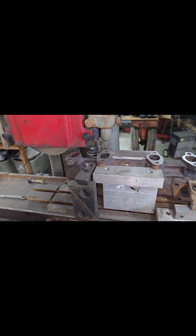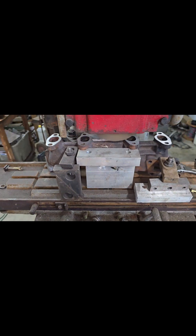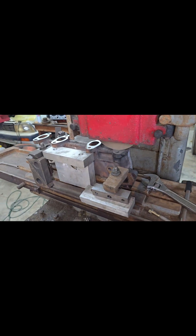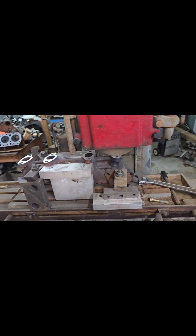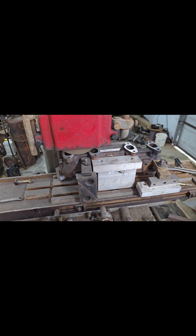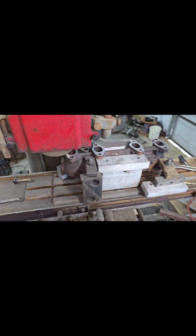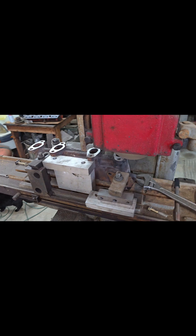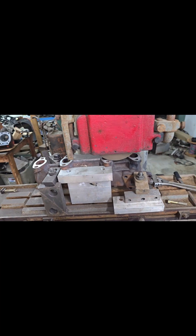This setup's pretty terrible — you shouldn't use aluminum blocks — but the trapezoidal flange was positioned in such a way that I had very few options on tying it down, so I had to go that route. It seems to be holding pretty good, and it's flat off the back sides of the flanges. Probably not the best way to hold it down — could have machined bosses with a little pilot to stick in there and balanced it on all four corners — might have had a better result. But it's going to be flat; that's the whole purpose of this machine.